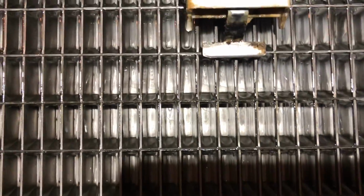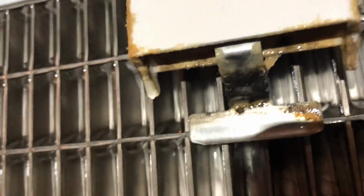So there, it was going into premature defrost. I just pulled the curtain off. See how thin the ice was, and it was going into harvest. Sometimes it could just be because it's dirty. Yeah, look at that, stalactites touching right there on the ice thickness probe. See that piece that's touching right there? That'll cause it to go into early harvest. So it looks like it just needs to be cleaned up right now.